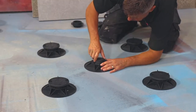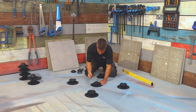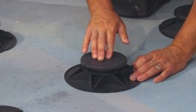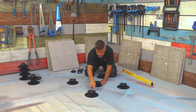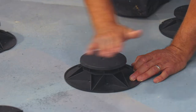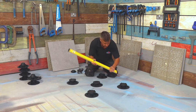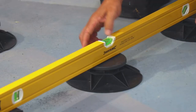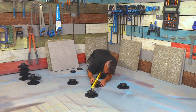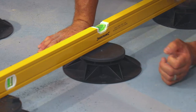Place another stem in here. The headpiece for the centre is actually a flat one, which will also get placed in there, because it doesn't need the little corner nodules standing up proud to stop the tile moving — it just needs to take the weight of the centre. So the next stage is to put your spirit level back across here, which may have moved it up a millimetre or half a millimetre. Hold that bottom little riser and turn that so it's just perfect on there.